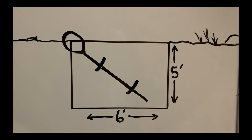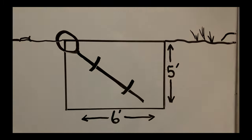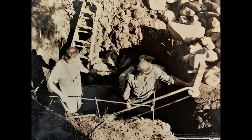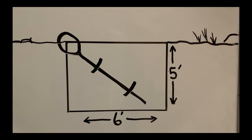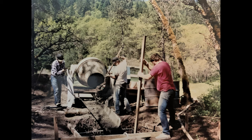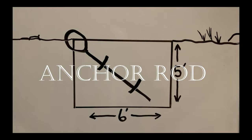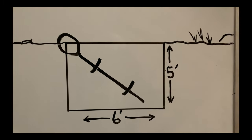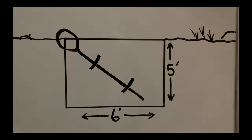The next two holes will be about 20 feet back from the A-frame. These holes need to be wide and deep because their mass will be your anchors, counteracting the weight of the cable, gondola, and everything you put in it. Here's John digging the hole — it's about seven feet wide, six feet long, and five feet deep, with lots of rebar. John used 50 bags of concrete — those are 90-pound bags — on each hole, mixed with a seven-to-one mix of sand and gravel. The total dead weight was 40,000 pounds for each anchor. The steel rod with a ring on the end is where the gondola cables will be attached, and it should have welded T's on the embedded ends so it can't be yanked out of the cement.